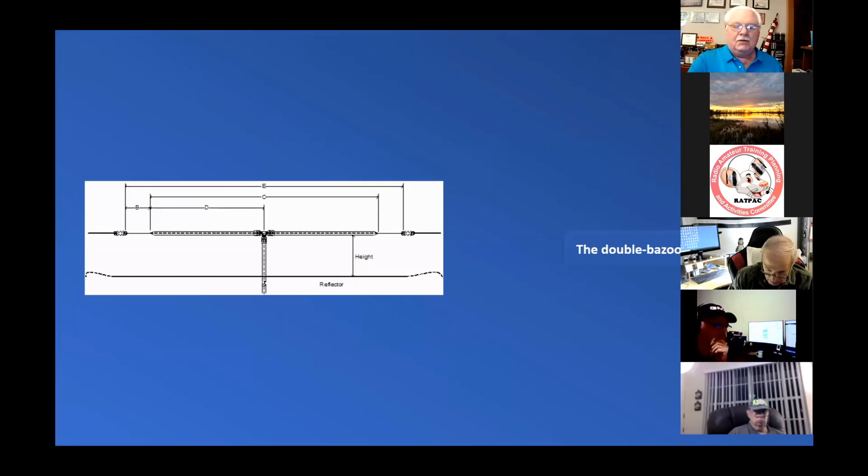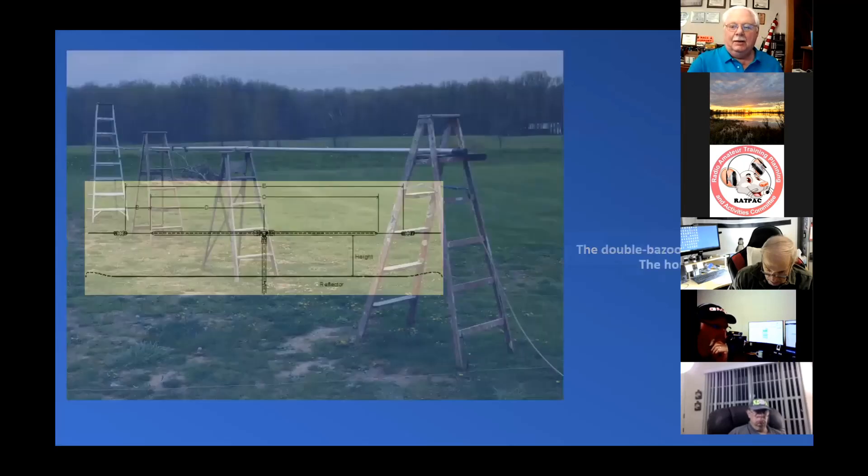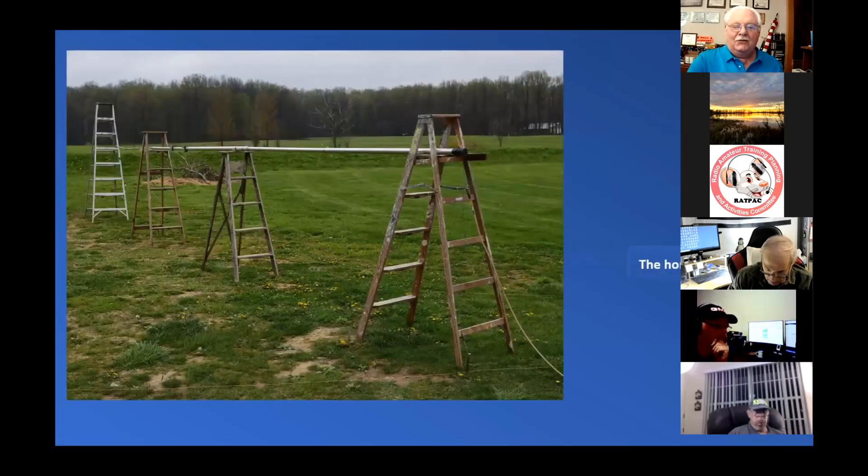The outside of the coax is the radiator, and the inner sections act as a quarter-wave shorted stub, which increases the bandwidth of the antenna. We used these at some old field day installations, and they were much broader in terms of frequency range. They're pretty good antennas. The question is will they work for you at a low altitude — and if all else fails, here is the horizontal vertical, which didn't work but made a great picture.